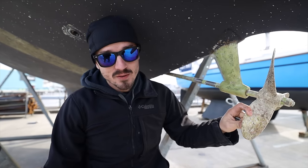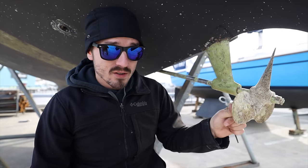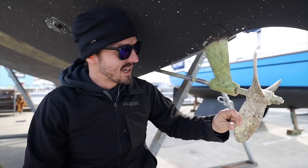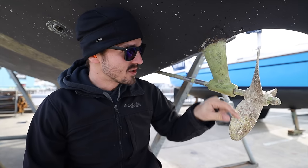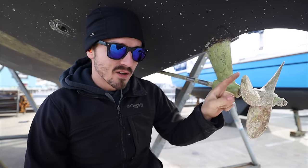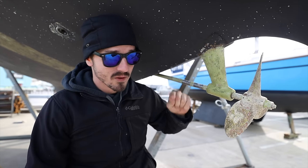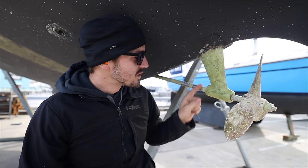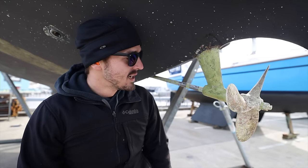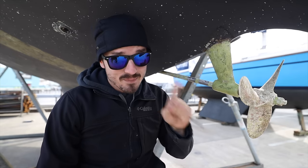Because we're switching to a sail drive, the prop and the skeg have to come off. Our prop is probably original — very, very old — and it's been turning pink since we got it, which is an indication that it's getting brittle. It's got a bunch of chips in it, so it's not really salvageable. Our prop shaft is also slightly bent because it has a little wobble when we use the electric motor. To save time we're just going to cut it off and send it to a scrap yard.